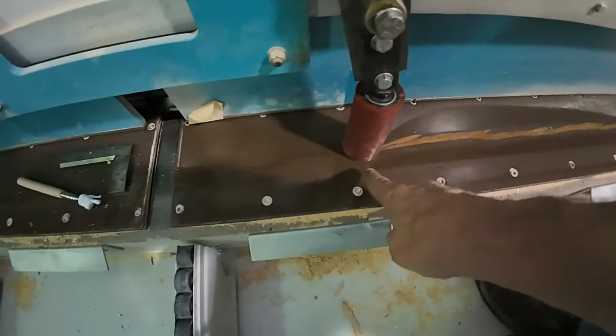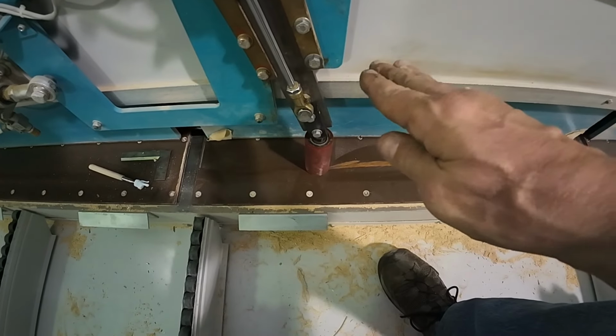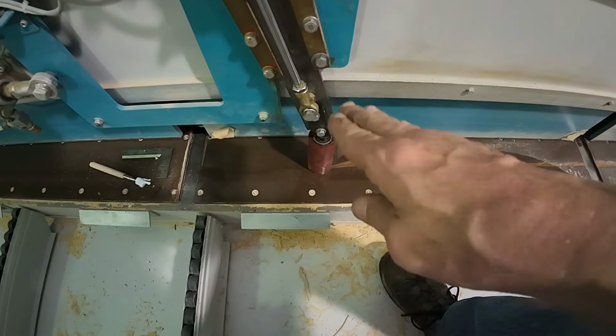So all we want to achieve with this is that whatever our minimum thickness material, let's say a 1/4 inch, 6mm Luan or something like that, that sheet stock cannot get underneath that roller. If it goes too low, then you scratch your throat plates. If it's too high, the material goes under it. So drawer bottoms, 1/8 inch drawer bottoms, stuff like that, that's where that dimension comes in critical. So you remember when I put that roller on, the roller had a recess. That's what the recess is for.